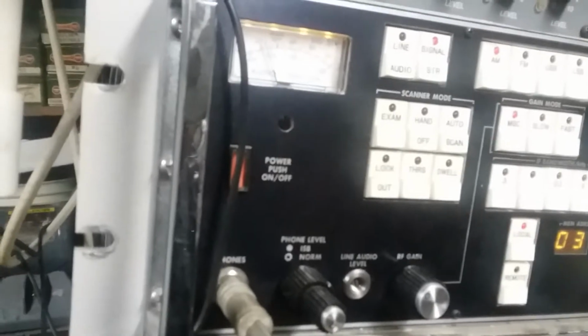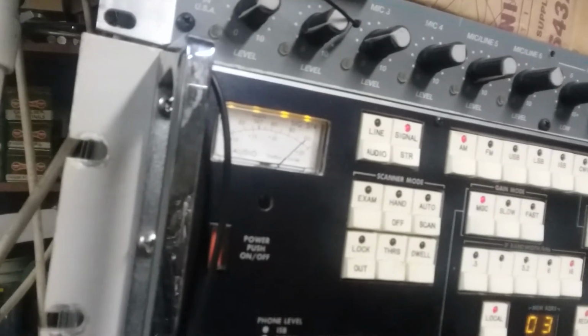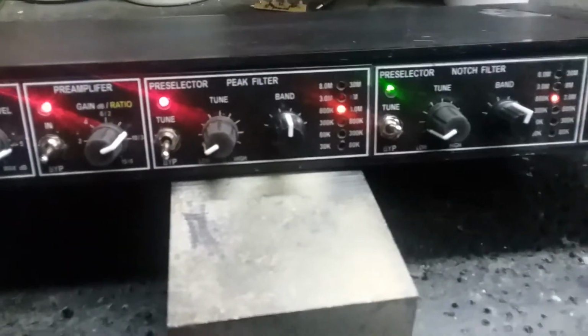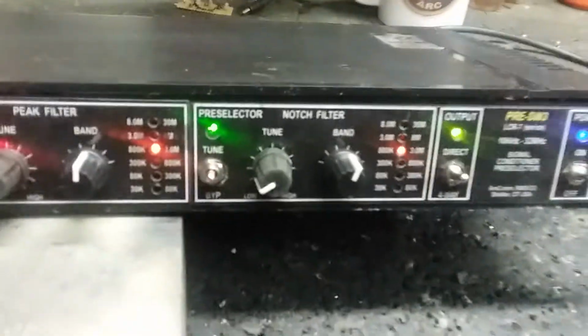Well, I'm getting glare today. I wasn't getting glare before. All right, I'm tuning through the notch thing. I really apologize for this. We're going off the notch, and I'm turning toward the frequency down, right down to dead air, just about. It is a measured 48 dB, and the peaking, depending on where you are in the band, is anywhere from 60 dB to 36 or so at the higher frequencies. So that's it.